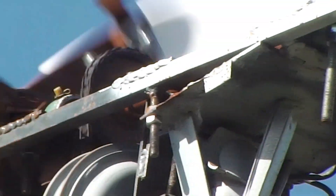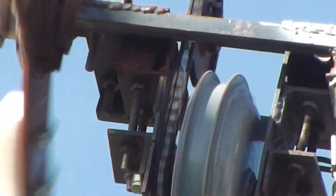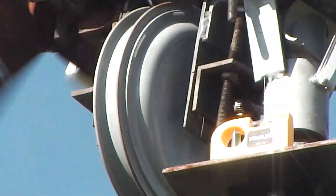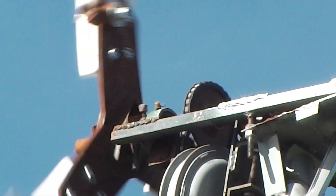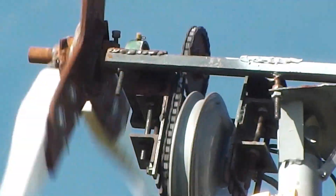The top sprocket is 28 tooth and that can be changed for something else. I've made it so it's tightened on by a bolt that goes actually into the drive shaft so it can't come off. The gear wheel on the front of the motor hub is also changeable, so I can use any different gear ratios that I want. It's obviously a bit of work taking it down and changing them, but there'll be a video about that soon because I do have another gear if I want to replace it.